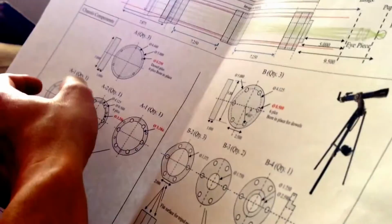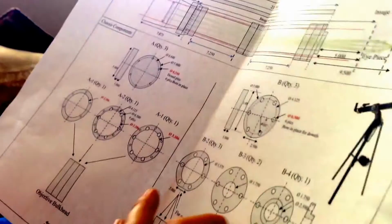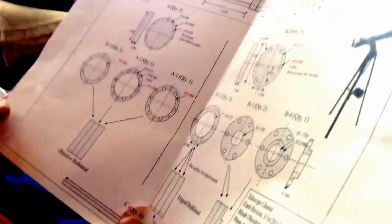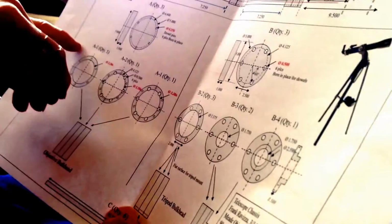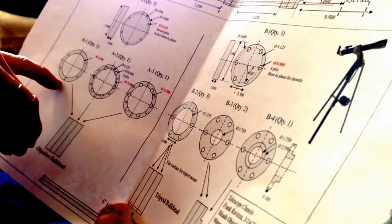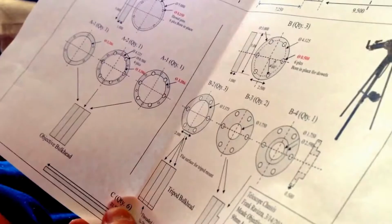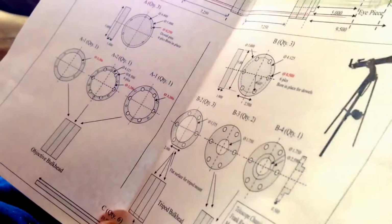So the mortise and tenon, how are you going to align each joint, each cut? How are you going to register, clock them so that they're all in line? Are you going to generate the mortise and tenons on the outer diameter in one operation? I may make these rectangular first, and then cut the mortise and tenon into the half depth, and then get the bandsaw and saw them out round. That's a good idea. That's my thought. It would be a bandsaw cut, and I would leave them a little oversized, and I'd sand them so they look decent.